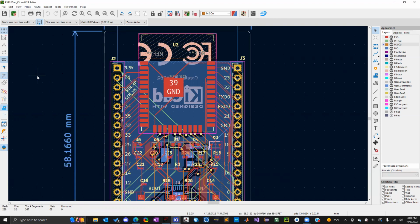It'll cost more money because whenever you have through-hole components being soldered onto your board, it's going to cost you more, because there's no machine that can accurately put every pin into the holes properly. So there's a person that physically has to put it in the board and solder it. That's labor, and you're going to pay more for that. Compared to the surface mount components, the machine stamps it on, puts the paste, puts it through a microwave, and it's done. So it's cheaper.